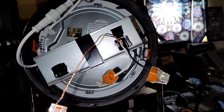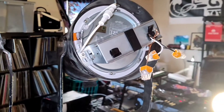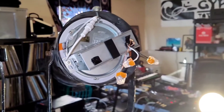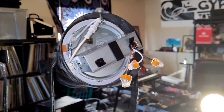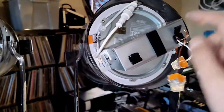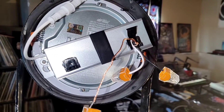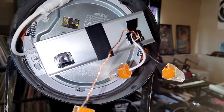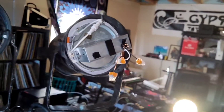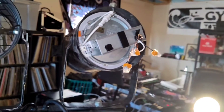The change in wattage is great. Here's a crazy thing too - it probably hasn't been done to a great extent yet, because LEDs that you try to dim without the right dimmer end up flickering and acting really goofy. But in 2022 - these actually came out in 2021 - they're meant to work with any type of dimmer. The circuitry is all built into these boxes; it's meant to handle the drop in voltage for whatever type of dimmer switch you have. They're supposed to be universal, so you shouldn't have to worry if this will dim or not. They work just fine.